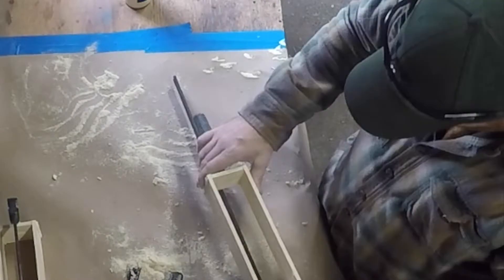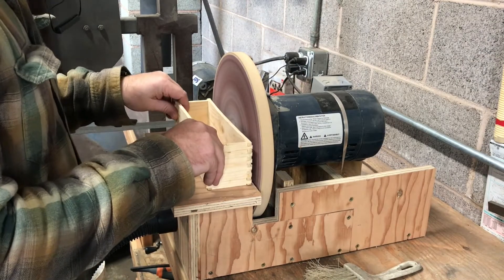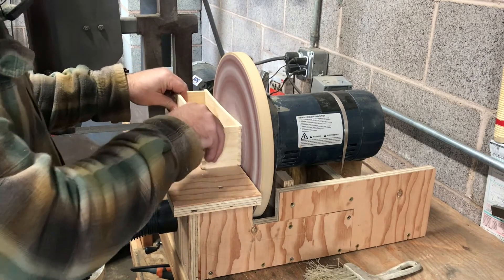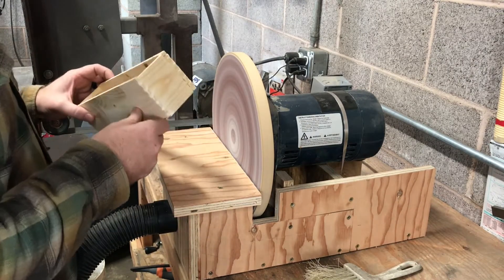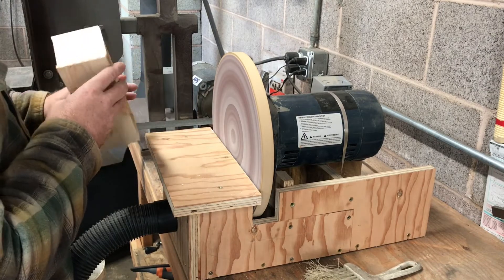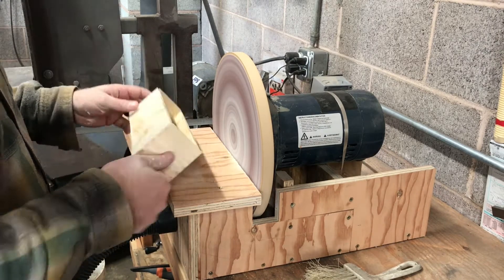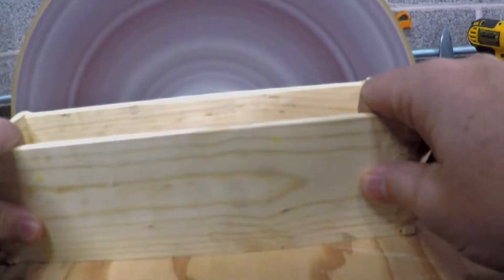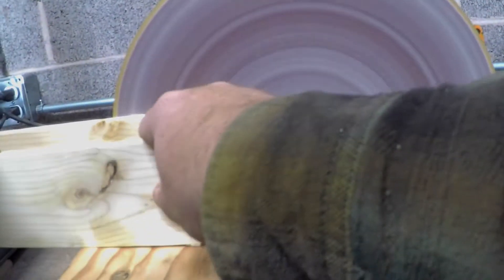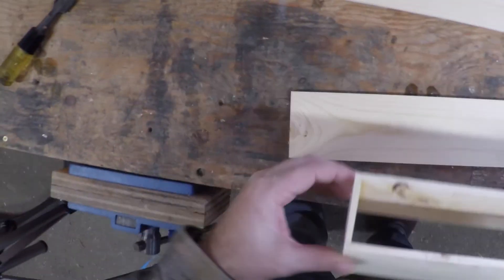The second one came out a little crooked so I put the clamp diagonal across there. Then I take it over to the disc grinder — obviously this is a homemade disc grinder, but it works pretty good. Just flattening out the edges — when I make box joints I always make the ends so they protrude a little bit, so I'll flatten those out. This disc sander leaves a pretty rough finish which I actually thought was kind of cool. I wanted it to look like an old, rustic wooden box, so I kind of left the sanding marks that tool left behind — and in the end I actually really liked it.